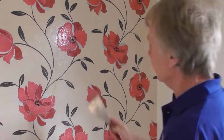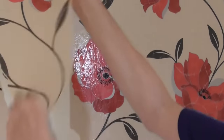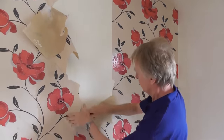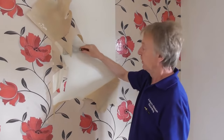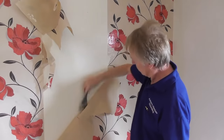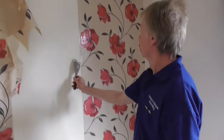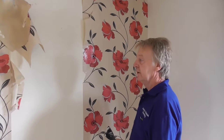So I'm going to start on the seam line here and go through there like that. As you can see, just by waiting around for the water to do its work, how easy it is to take that paper off. And I'm not damaging the wall because I let the water do its work, and I'm keeping the scraper at a low angle so it's not going to dig into the wall. Nice and easy to get the paper off now. I should have the rest of this off within the next half hour, ready for the next stage.